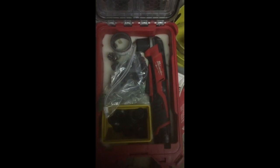So it's also important to plug your holes when you're done. This is my kit I have set up that I use for all my static and temperature measurements. I've got some 1/2-inch plugs. Personally, I like the flush mount plugs. I carry some 3/8 plugs. I also have some 3/8 metal for combustion testing. They're in a different location. Then I also have these 1-inch duct plugs. These are often used by duct cleaning industry. I got a bunch of them for pretty cheap. I forget where. Rest of them come from TruTech Tools.